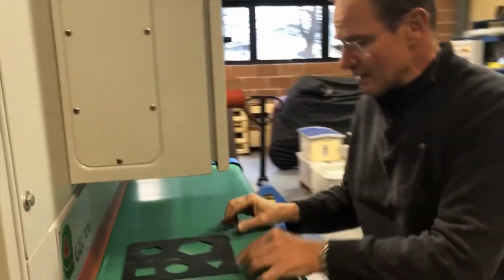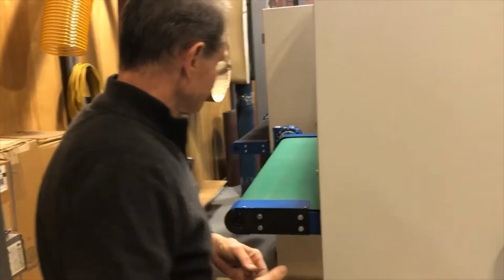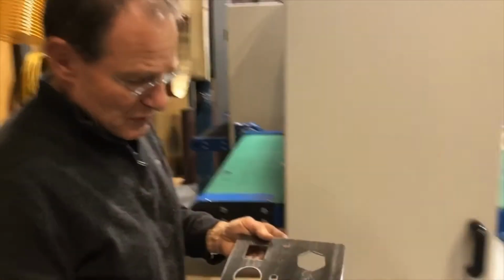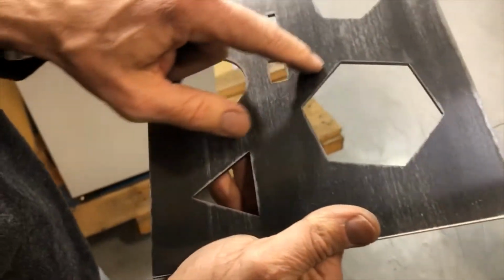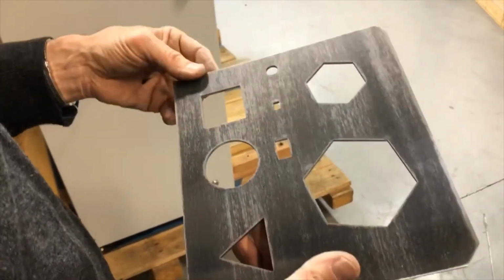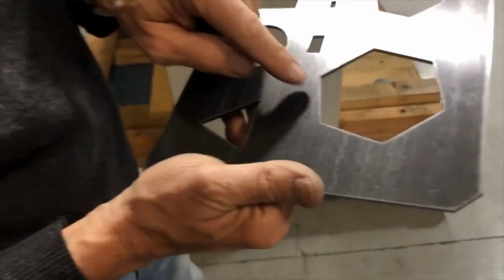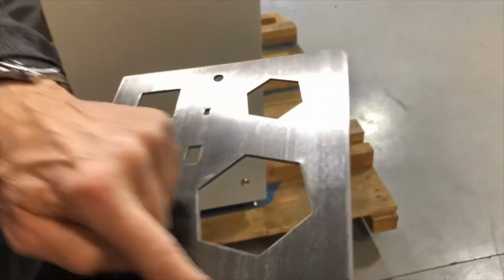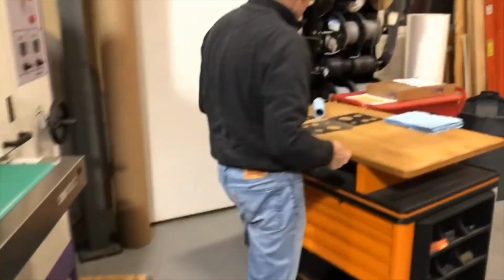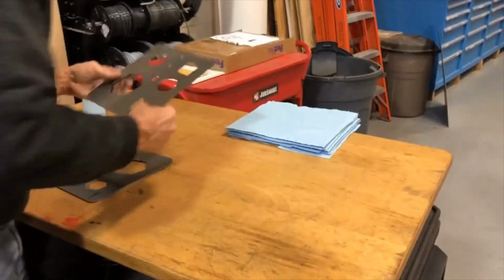And we're going to go lengthwise, so if there is a grain, we make a nice straight grain. High friction belt holds the part very well. So you see that we grind this very lightly and we have that silver ring. A lot of the black surface is still on there, the mill scale surface, which is fine, that's what we want. And because it's a softer contact drum, we touch a little bit sharper on the edge. So, we're going to keep this for now and then run this in a minute. And then we have a second piece here that we're going to do the same thing with.